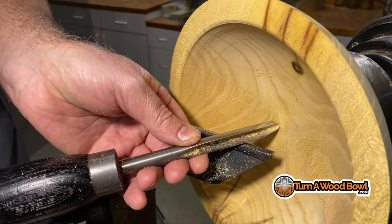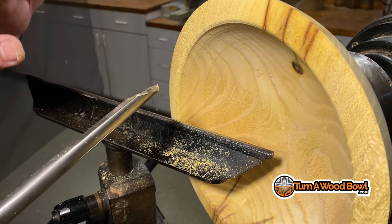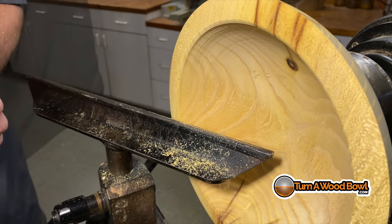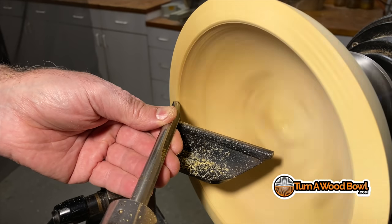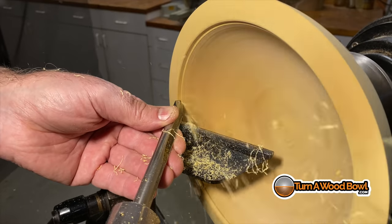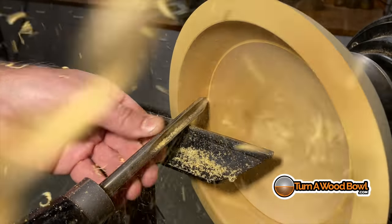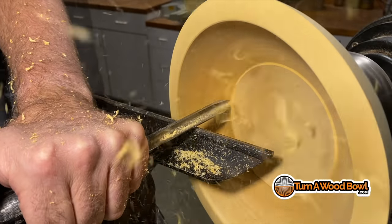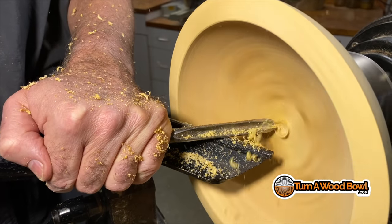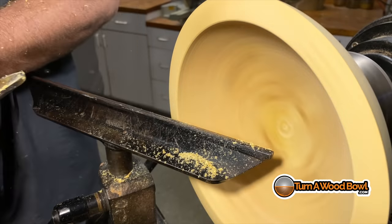When we get to the center point, we want to close that again to about the 90-degree angle so we can make a nice clean cut across that center portion. This is a general position for the bowl gouge through a regular cut. So we're going to start off at about a 90-degree angle and establish an edge, then open up the bowl gouge, and then close it back to about 90 degrees right at the center. And that's how we make a typical pass.